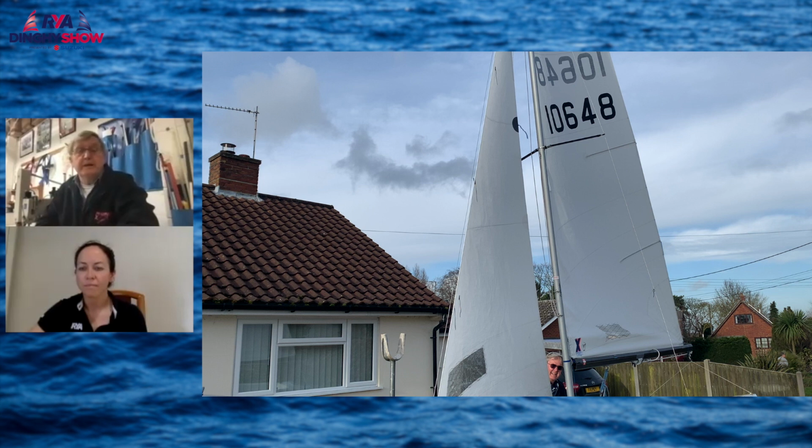And by the way, the wider the jib, like on a GP Wayfarer, the lower they can be. The narrower the jib, Fireballs, Hornet, closer to the middle it's got to be. A sail, any sail, is at its most efficient when it's deflecting the air the least amount possible. So by easing the sheet, getting the top telltale just into line, makes the whole jib work that much better.